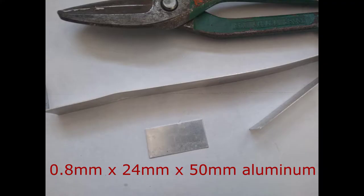This throttle took me about an hour to make and a couple hours experimenting to come up with the design. Materials include a soft metal strip. I used aluminum, but other malleable metals might work also. The thickness was just under 1 millimeter and just happened to be stuff that I had lying around in my garage. Note that the thickness needs to fit between the ribs. You do not want it to be too thin as the part will not hold its shape very well.